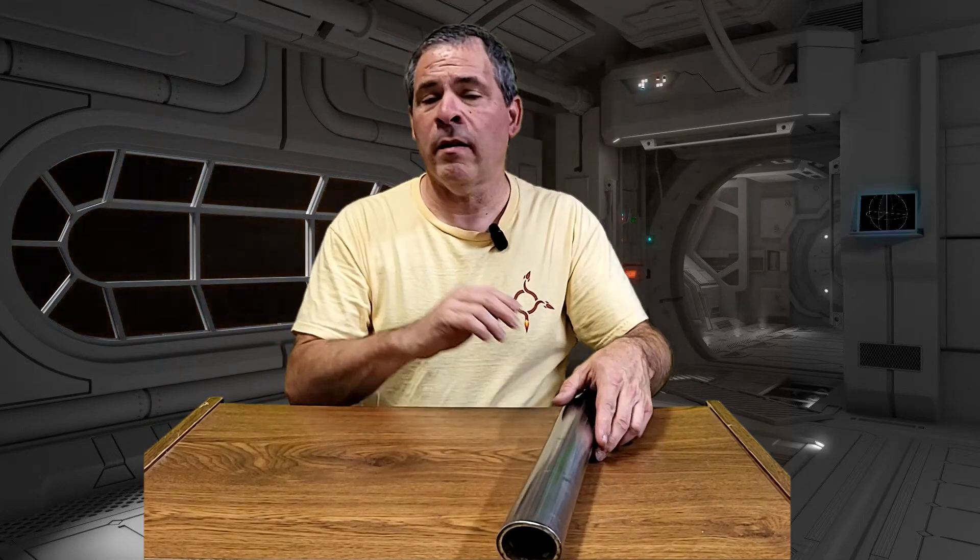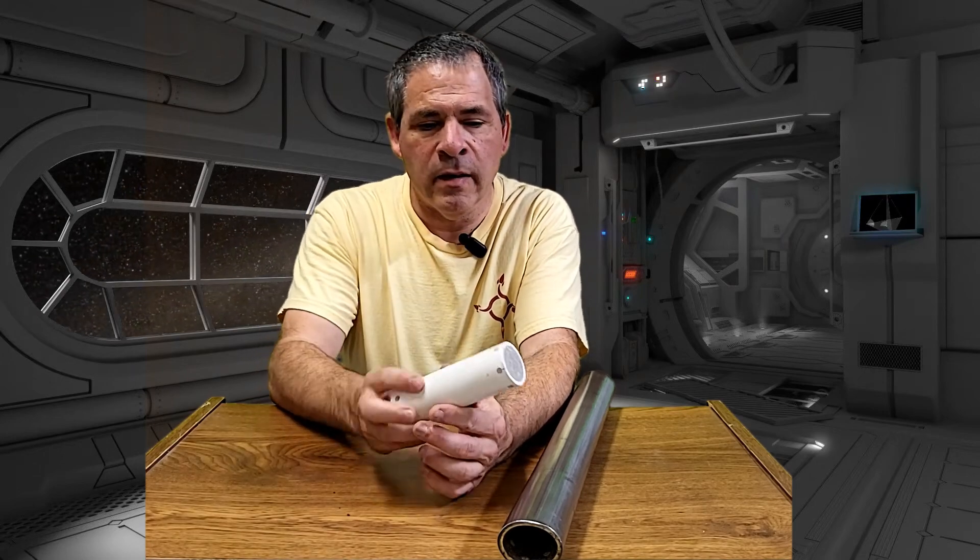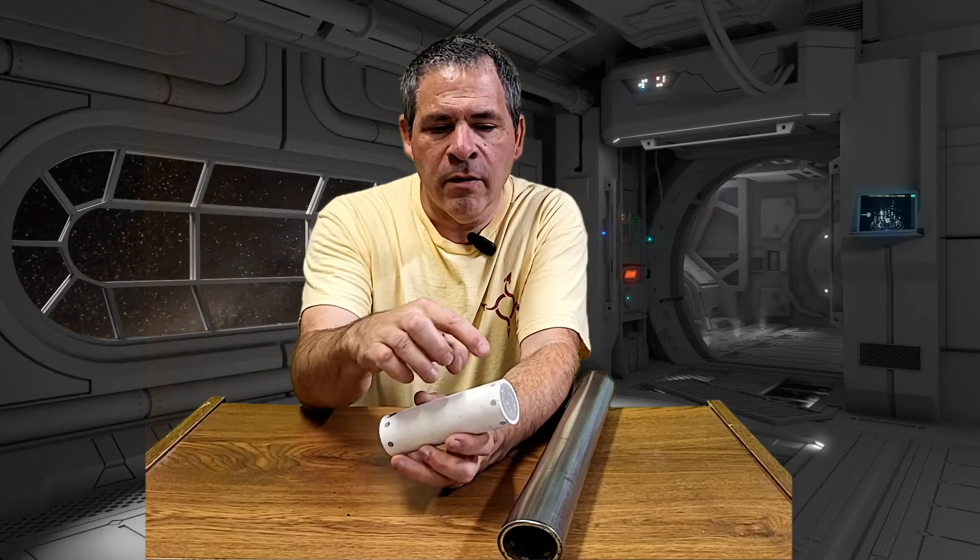The motor performed very well with the exception of blowing out the bulkhead end. So we're going to work on making some improvements to how both the bulkhead and the nozzle are held into the motor. The bulkhead and the nozzle of this motor are made from anchoring cement, and the way they're held into the PVC pipe is very similar to how it's done on the modified dart monkey — we drill a series of holes around the PVC so that when the anchoring cement is poured in, it fills in those holes and keeps the anchoring cement from pushing out.